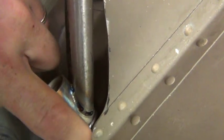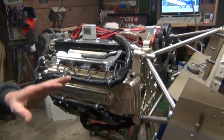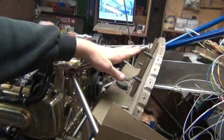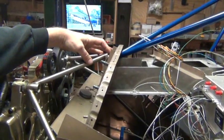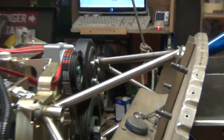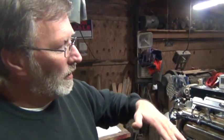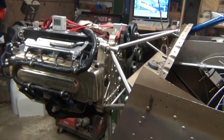Coming from right here you can see it probably better — right up in there you can see the spacers. My question is: this affects the load path from this mount to my upper cabin frame structure. Is this an acceptable method of connecting these? Or should I get another mount? It seems that my firewall is in approximately the correct position, but my mount is leaning my engine up. With no spacers and the mount secured to the firewall, the engine rests at a 3.5 degree nose-high attitude, which is not what I need.